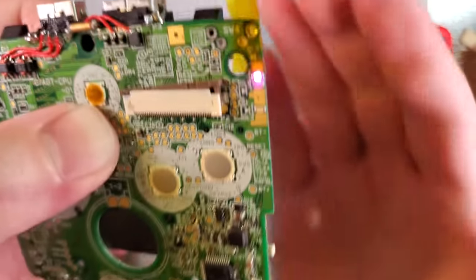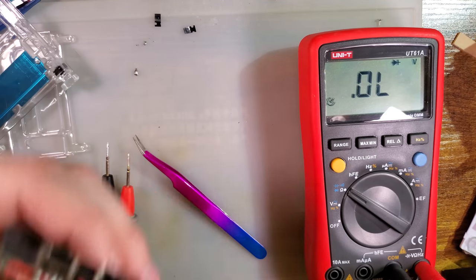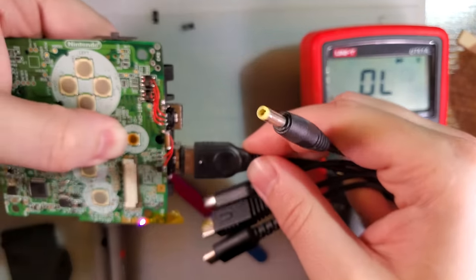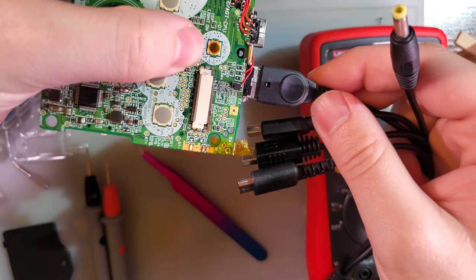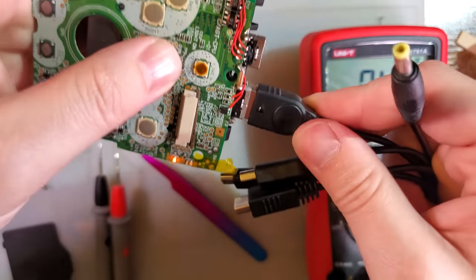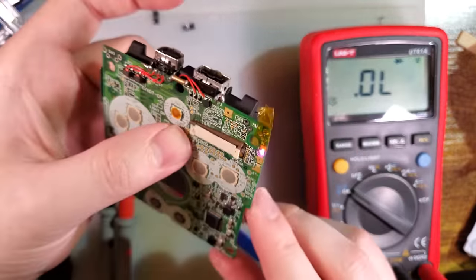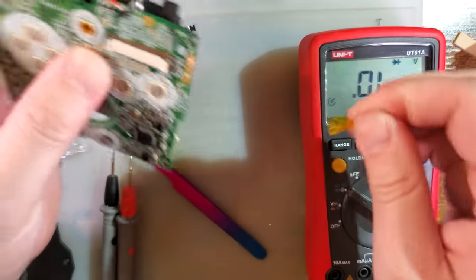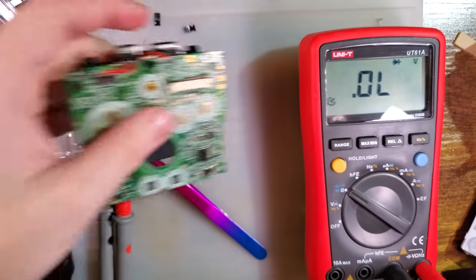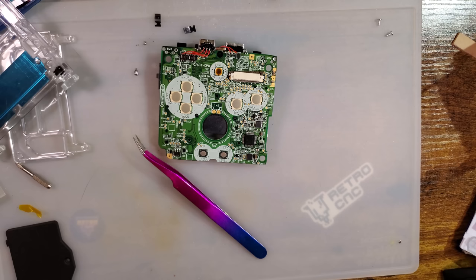Hopefully I didn't melt the low-power LED, and I sincerely doubt I even touched the charge LED. But that's good too. It switched off because I'm holding the battery in, and I wasn't when I plugged that in. Go ahead and remove the Kapton now. You can see I didn't get any solder on that gold pad, which is what I was going for. And we are done with the big meter.